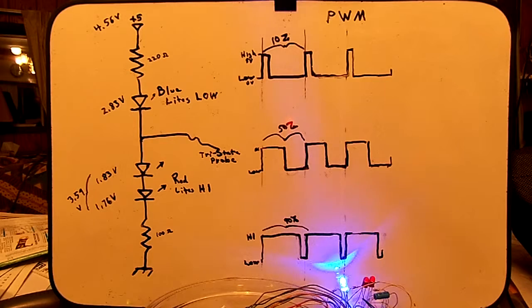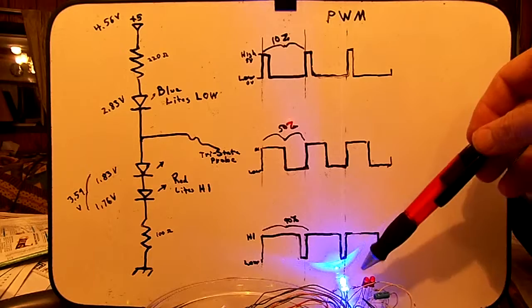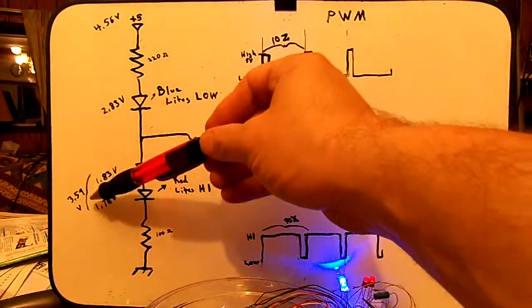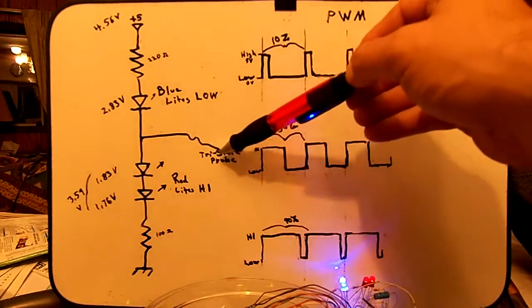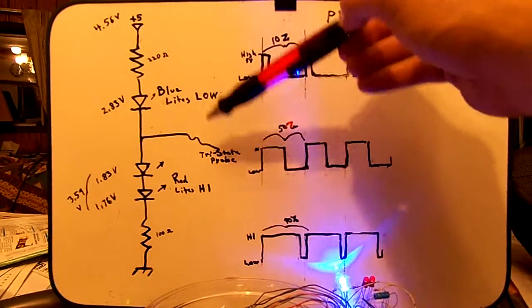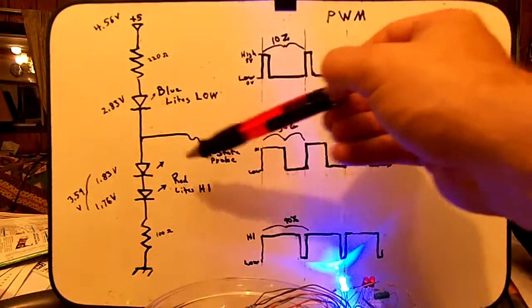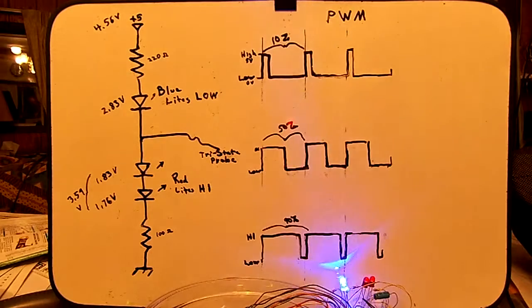So the other thing I wanted to point out is I did some actual voltage readings just for yucks. Now this is my two LEDs in series idea again, except I wanted red for the positive side, for the hot side. So I used two red LEDs in series to make up for the low voltage drop, to give them a higher voltage drop. So that gave me a 3.59. And I did this by putting the probe into a ground at one point to light up this LED, and then I put it to hot to light up these LEDs, a high and a low. So that's how I made these measurements. So they weren't made simultaneously. That's why they don't add up. But you see, they add up to something higher than 5, although just barely. That's why it won't light up without something happening here.